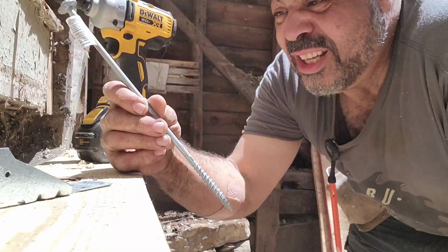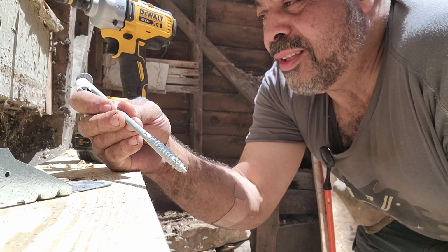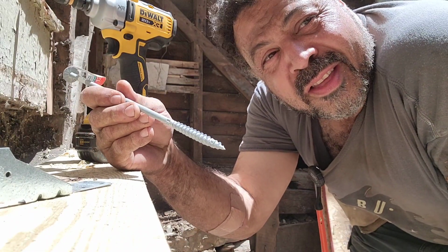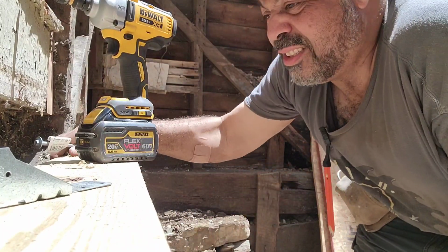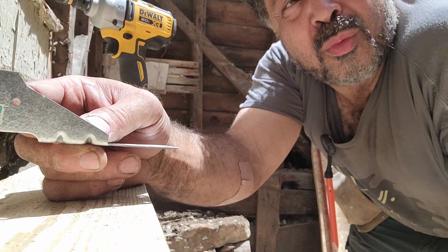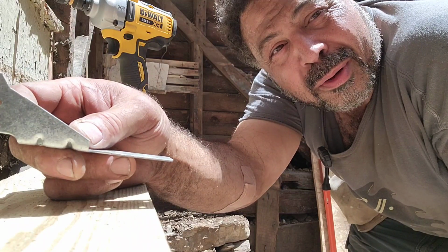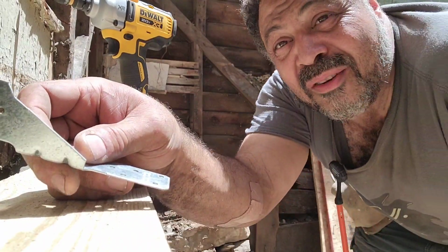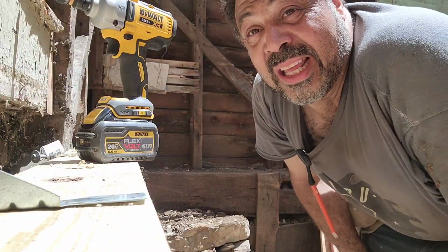We've got these 12-inch long Simpson Strong-Tie bolts that we're bolting these two beams together with. And that's got this sucker tight. We're taking hurricane clips and we're cross tying with the original balloon studs in here, so that way you've got this locked in the plate, and we're squaring it up and leveling it out as we go through. This thing will not go anywhere anytime soon.